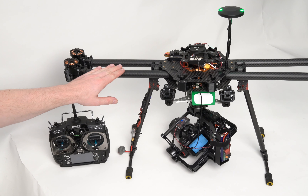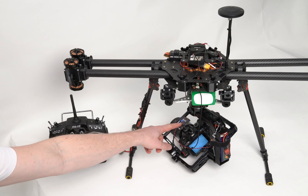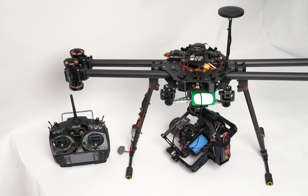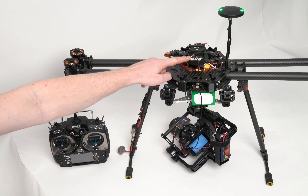What you see is a testing drone setup equipped with Pixhawk Cube. Under the drone is a gimbal with an A7R2 camera and Air Commander Entire. The Entire is connected to the Pixhawk by a single telemetry cable connected to the telemetry port.